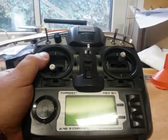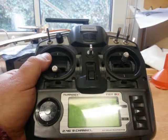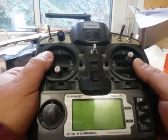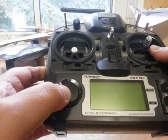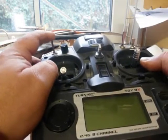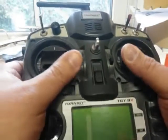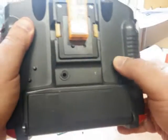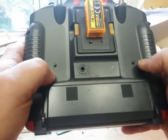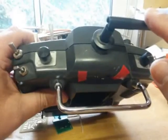Someone asked me a few days ago on my YouTube channel if I could show my AR9X board inside my Turnigy 9x radio, which is upgraded with a few mods: an encoder, a three-way switch replacing the two-way switch with a three-position switch, a slider on the side, Taranis gimbals, four push buttons on the back — very good for voice prompts or for doing stuff like turning lights on and off. This is a multi-protocol module and here is a FrSky module as internal.